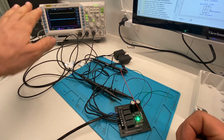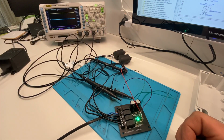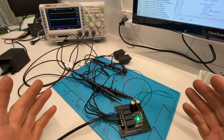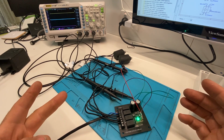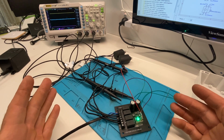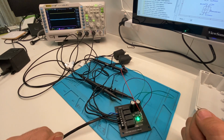Now I've got it connected up to the oscilloscope. We've got two solenoid valves just here. Now bearing in mind that when you've got a reticulation controller, two is usually all you'll run. You'll have the main valve and you'll have a station that's going. So you wouldn't normally have any more than that turned on. So we can turn those on to test out to make sure that all works okay with the two valves